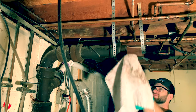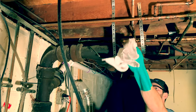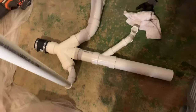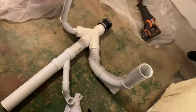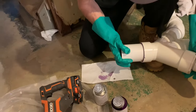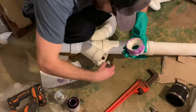What I'm doing right now is wiping down the cast iron pipe that we cut, just so that we don't have any debris in the way when we go to put the FernCo coupling on and connect the new PVC segment. Before we put anything in place, we put all the PVC together and did a dry fitting to make sure it was going to fit up in the new cast iron segment. That's a piece of our little apparatus right there, and then we started gluing it once we found out that it worked. Here we are using our PVC purple primer and our PVC cement to glue everything together before lifting it up in place.